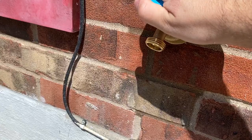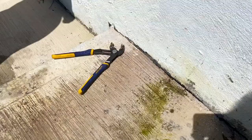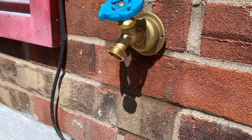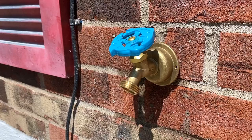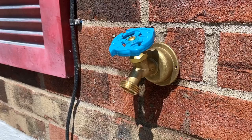Just to prove to you guys that it works — there you go. That is how you install a brand new faucet outside. These shark bite faucets are extremely easy to install. All you have to do is cut the pipe, clean it a little bit, and pop it on and you're ready to go. That is a real easy method you can use to install a brand new faucet on your rental property or at your house. If you enjoyed the video, make sure you hit the like button, subscribe to the channel, and see you in the next video. Peace out.